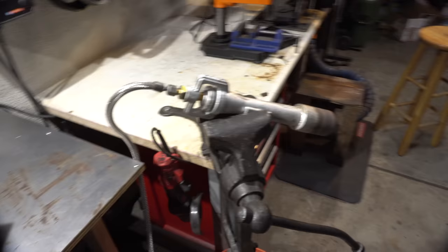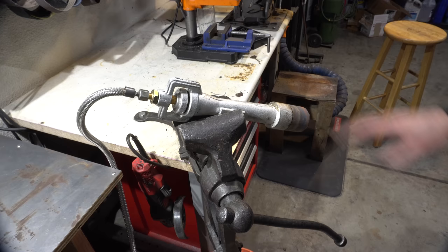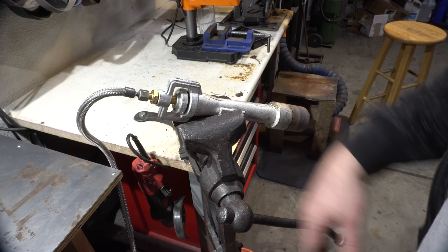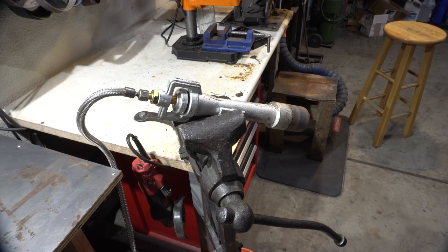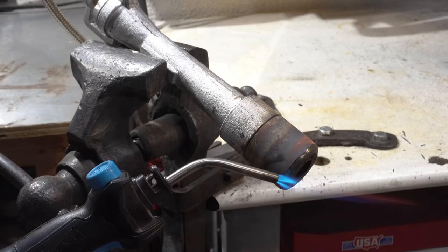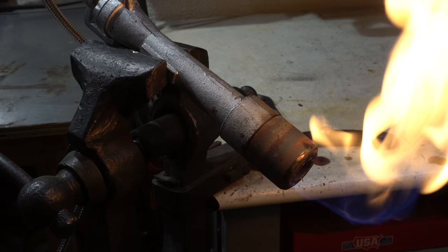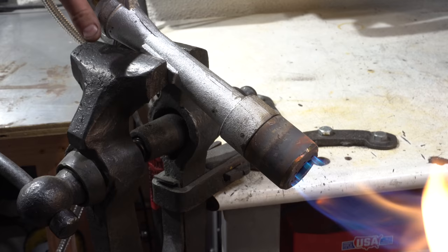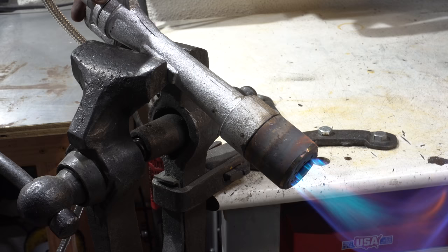Now I want to move on and test the burner in a controlled environment out of the wind. The burner is one of the best parts of this forge — it's a really good burner. I love this flared design with the holes in the bottom. I'm going to light it up here and show you the flame at the tip. We've got a little bit of gas going to it — not very much. I'll open this up a little and give it some air. You can see I really like how the flame comes out. You don't have one big flame — it's almost like a tiny ribbon burner. So that's a really good design.